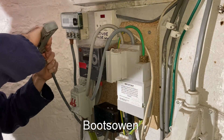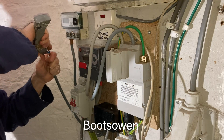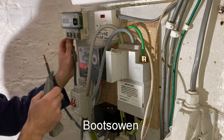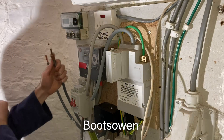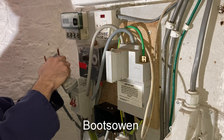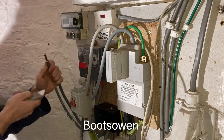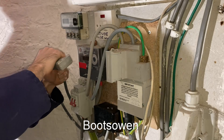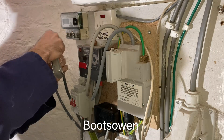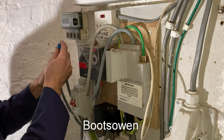The point in doing this is to see if I'm feeding into the grid — just to see how much it is. I know I am, because when this light here stays on constantly and that light stays on constantly, it's an indication that you're feeding into the grid if there's a reverse flow. And if there's a reverse flow I'd like to know how much it is, because that's the amount of electricity that I'm generating and wasting.